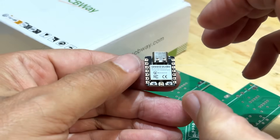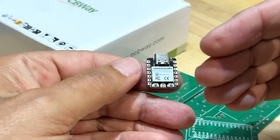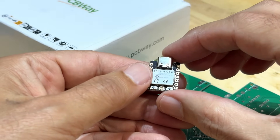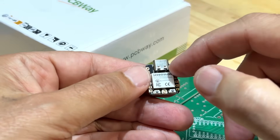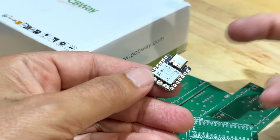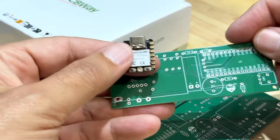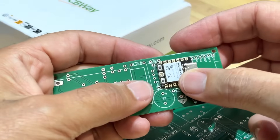This thing has got sleep mode. You can put it on sleep mode with programming, which means you don't really need to switch it off - you don't really need an on-off switch. When it's on sleep mode, I think it draws like 47 nanoamps, something stupidly low. Then when you push a button or trigger an interrupt, it'll wake up and start looping again. So this is going to solve a few issues, one of them being the size the final board needs to be.